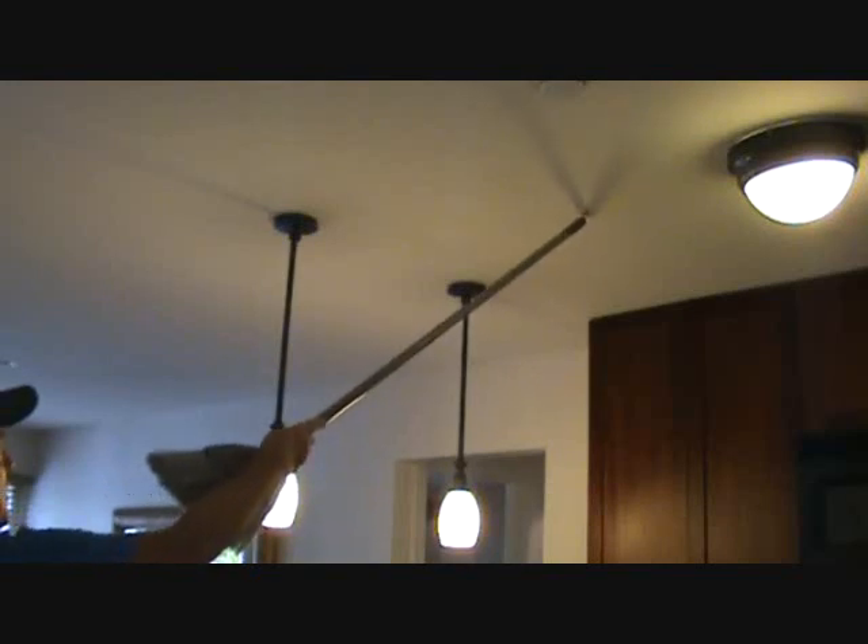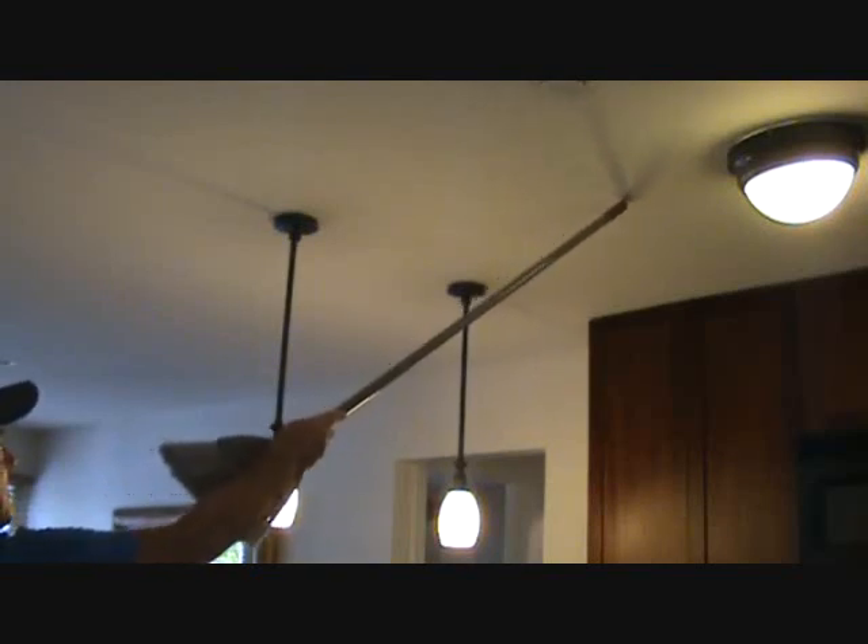This is only an eight-foot ceiling, and that's kind of a good thing from my point of view because my patch should blend in well. It's not going to be so bright that I'll see exactly where it is, especially if the paint doesn't match a hundred percent. If I take that paint out over here, it's just a little bit shady over in this area. So when I paint, I'll probably come out this far, maybe even a little bit further.